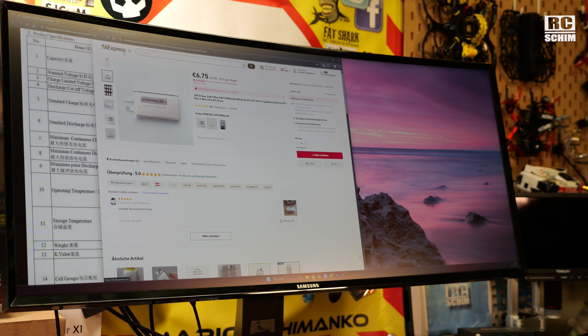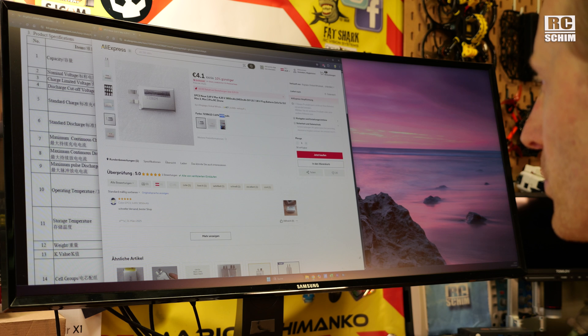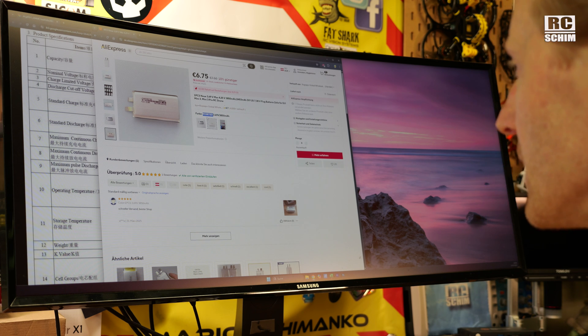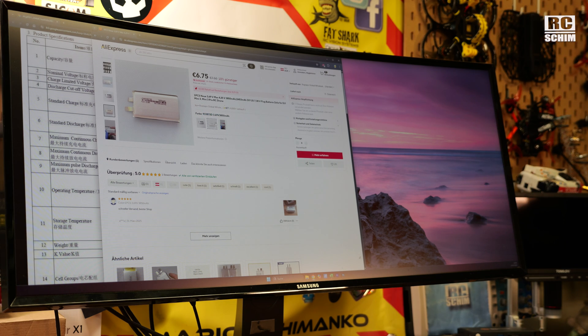The catchy thing is you can get those on AliExpress. For me it took around 2 weeks for delivery. By default the link goes to the smaller cell, so pay attention — it's only 2.4Ah. You need to take the middle one: under color it says 933872D. For one pack you pay 28 euros, which is really not a lot. One downside though — sorry to my viewers in Germany — apparently AliExpress doesn't deliver those cells to Germany. I tried a lot of other countries and all of them work as a destination, but not Germany.